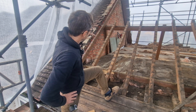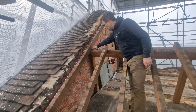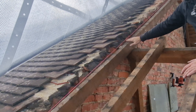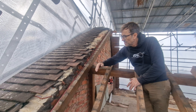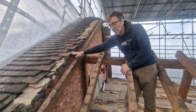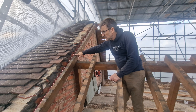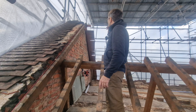Before cutting that out, I want to show you what else happens to roofs when they fatigue. So here's your purlin, your strut, and your rafter. Angus, who's helping me, has attached a piece of string from the top of the rafter to the bottom of the rafter. You can see how much space there is between the string and the rafter — that gives you an indication of how much everything's dropped. If you look at this existing party wall — a really thick solid fire break — all the timberwork stops either side, and the roofers years ago cemented up the middle. What happens is it obviously sinks; the struts bear down on something not meant to take the load. That's how much it's sagged.